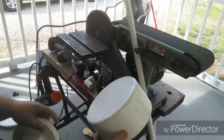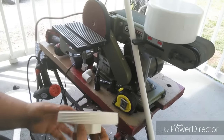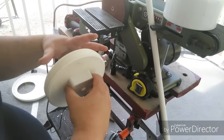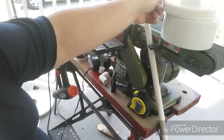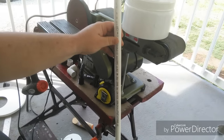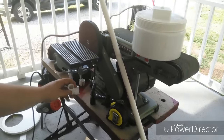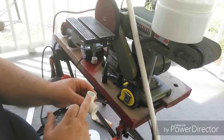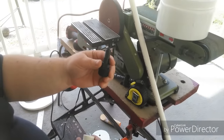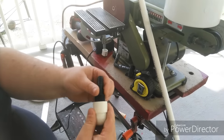What you're going to need in this video: you're going to need a cap — it's a six inch cap. You're going to need a screw-in washout cap; all you're going to need is just the cap, not the thing that it screws into. Just the cap. You'll need at least a five foot piece of half inch PVC pipe. You're going to need an elbow, which is a half inch with three quarter inch threaded on the three quarter inch. Then you're going to need a three quarter to a half fitting — you'll find this in the irrigation part — and these two go together.